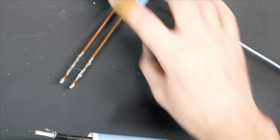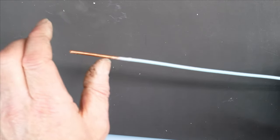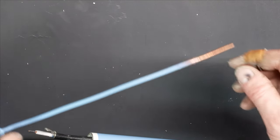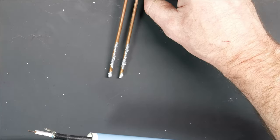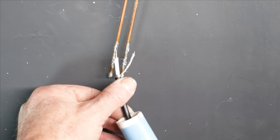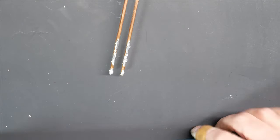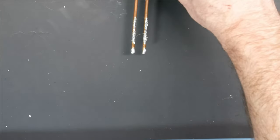So there's two adjustments to this antenna. The first adjustment, of course, is going to be by sliding our brass cylinder in and out on the ends. And then the second adjustment is here in the middle. So we can change where the coax goes on. We can move that connection in and out. And it does two things for us. It changes the total length of our antenna a bit to tune. So it's another way to make a length adjustment.